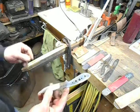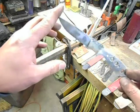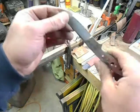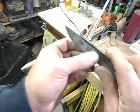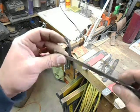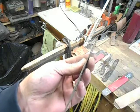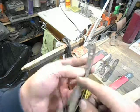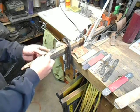So let's take one of these slightly modified Carter Pattern Neckers — sixteenth inch stock, probably about a three quarter to an inch wide blade. This one I decided to leave the finger choil out, just to see how I kind of like that. You can see this part right here has still got heat treating scale, and the bevels have been finished down to maybe a 220 grit or 120 grit or so. Generally speaking, I will take a blade and clamp it edge up or spine up in the vise and go ahead and clean up the spine before I do the flats. But we'll go ahead and do the flats right now anyway, because cleaning up the spine doesn't take very much time at all.